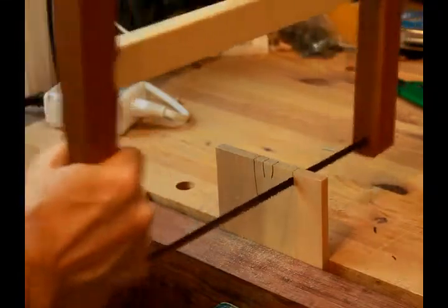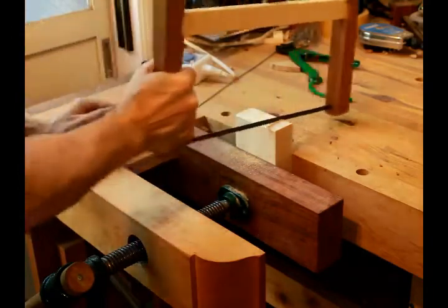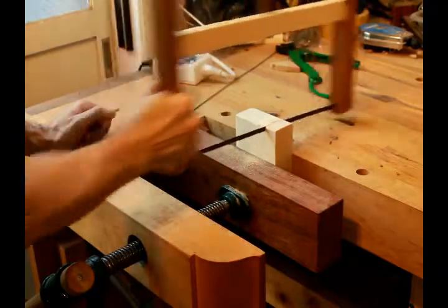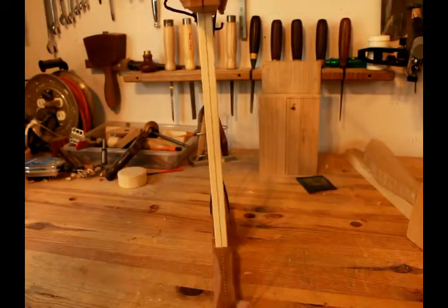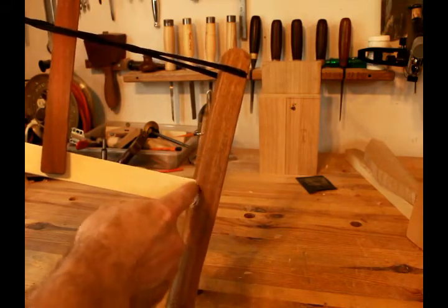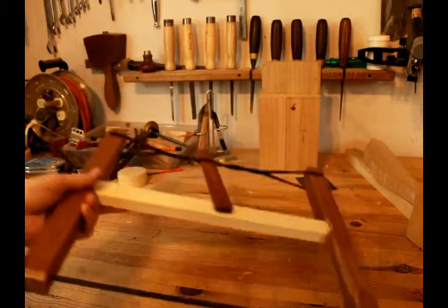So I started thinking about how to fix it and tried to troubleshoot. I found that the tenons on the middle portion were a little bit loose, which caused the saw to rack when I tensioned it. So I went back and made the tenons a little better so they fit more snugly. This seemed to solve the tracking problem to a certain extent, at least on a rip cut. When I switched over to a crosscut, the saw would again drift to the right. It was indeed racking — not quite straight. The reason is that the centerpiece is smaller in width than the handles, which means the curved shoulder isn't thick enough to keep the centerpiece from racking. So I just have to make another centerpiece with thicker wood. Lesson learned.